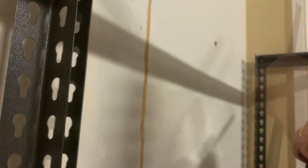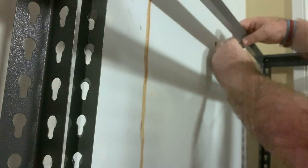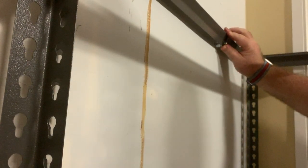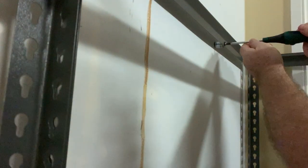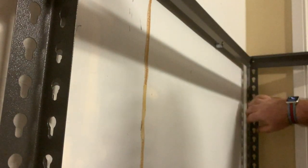What I'm going to do now is load up some washers, take my bracket, and load up the back of it with a heap of zinc washers to space it out. There's the screw — I can feel the bolt has hit the front of the fixture on the other side. So that wall bracket is now fairly tight against the wall, and then to finish off I can simply pop the final shelf on top.